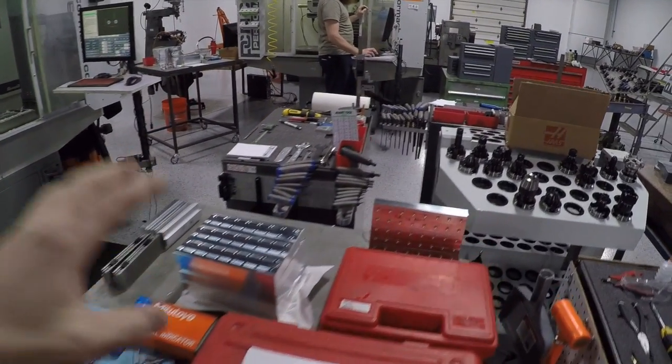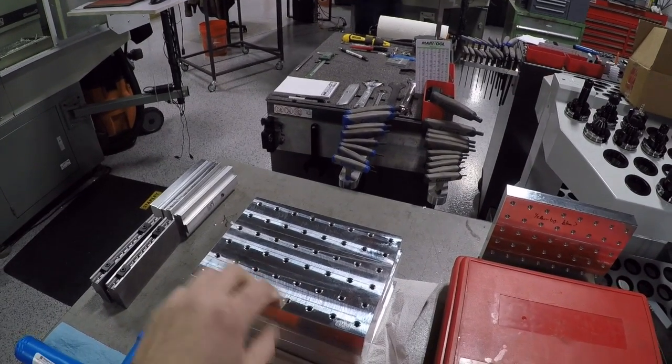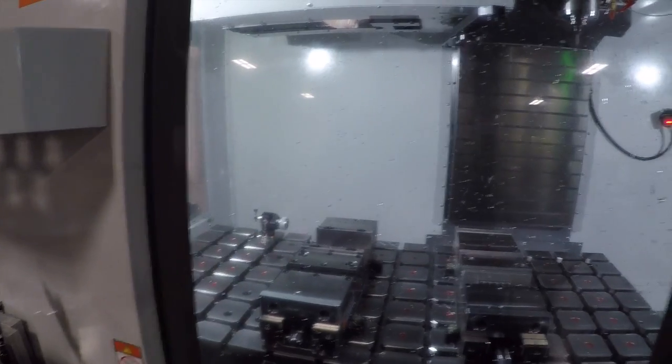What's going on with the Haas? We're dialing in our fixture plates — we've got them up on our website and we've been selling them. It's amazing how much time we're spending dialing in the whole recipe: figuring out speeds and feeds, work holding, and fixturing. We've been interpolating the holes, which is phenomenal, but I'd rather ream them if I can — it's faster and more consistent in terms of end mill deflection or wear. I haven't been happy with the reamed hole, which is kind of weird. We're doing mid-part probing in Fusion 360, multiple stations, multiple offsets. The finishes are primo. Once I get this process locked down, that's when I want to share the first Haas video with you guys.